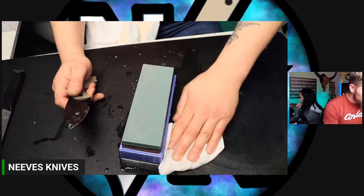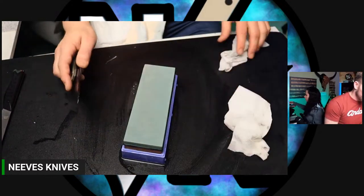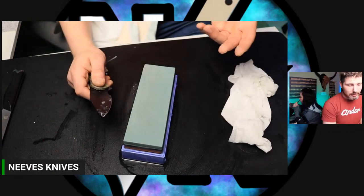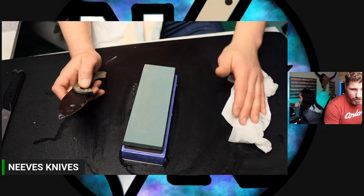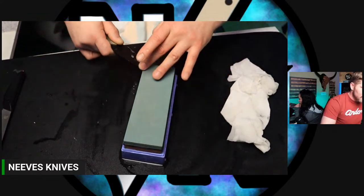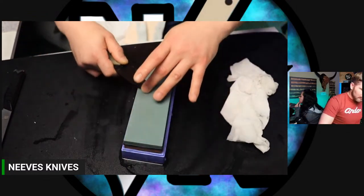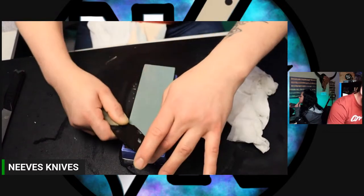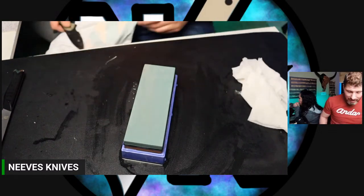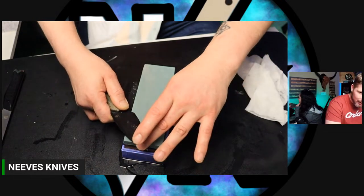See, this is one reason why I'm not a huge fan of whetstones. Not saying they're not cool and they don't have a purpose. I think they're really good for chef knives. That's the one time when I do recommend them the most. But why deal with all this mess when I can just use a diamond plate dry, or even a resin bonded diamond stone that is just a splash and go? That's way easier than dealing with this mess. But like I said, these are really good. And I do think that you should learn on different types of stones like Japanese water stones because it gives you versatility. These stones do work amazingly well, especially on chef knives. I honestly probably prefer to sharpen carbon steels on natural stones. The edges just come out so good. But there's nothing like a diamond plate, man. It just gets your edge so keen so fast and keeps a lot of bite.